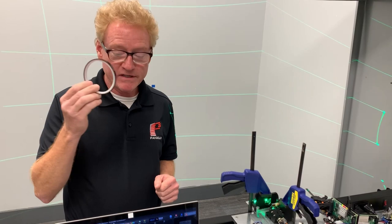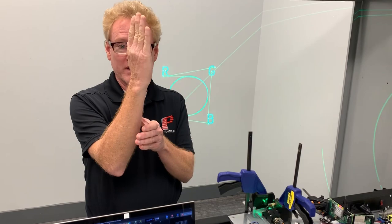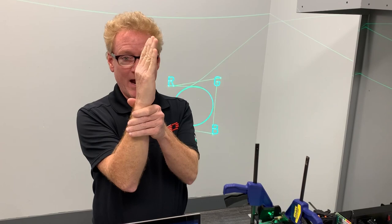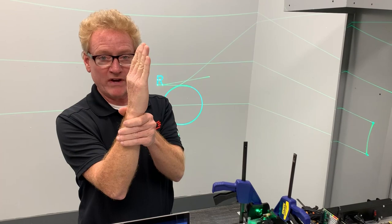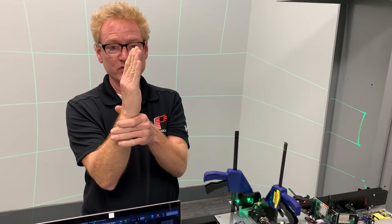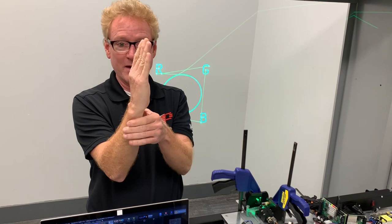This is the scanner and this is the mirror. What's interesting is that when the mirror rotates, there is a gyroscopic precession that happens. If the mirror is off balance from side to side, when it rotates there's a force that tends to bend the mirror. You can add as much weight as you want on the back or front of the mirror — that doesn't throw off the balance. It's quite counterintuitive. But if the weight is off in this dimension as it rotates, it causes what's called cross-axis wobble.